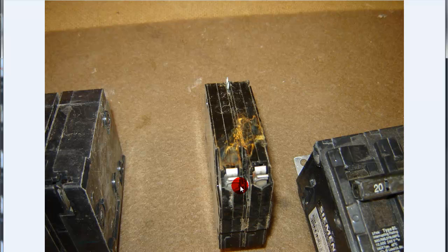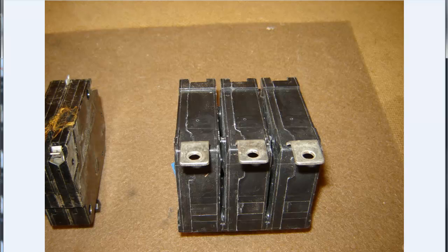There's an old QO — I think that was the 2-pole 15. It's got a little clip in the back to make sure that when you insert it, it goes between phases — that'd be like an A phase and a B phase on a single-phase panel. You can't put that in a slot for just 110-volt. And there's the ITE 3-pole bolt-on, type BL. You've got to watch these feet — the different styles. Some of these are just flat tabs that come out; some of them have a little bit deeper foot on them.